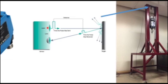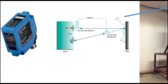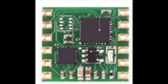A change to the rig this year will be depth measured from the rig floor rather than the top of the sample. Torque will be measured using both an indirect sensor and a direct sensor. Downhole vibrations, inclination, and azimuth will all be measured from a single sensor in the BHA.